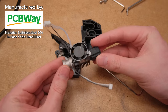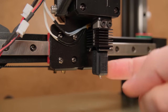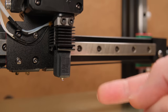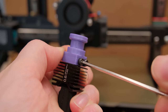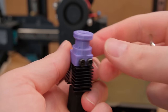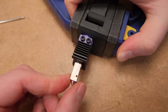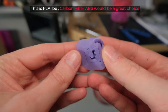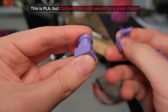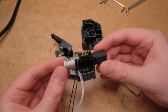The metal version allows you to tighten the hotend as much as M3 screws allow, meaning an extremely rigid assembly that acts almost as a single part. Meanwhile, the printable version is from plastic. This means you won't be able to clamp the hotend as much, and if you crash the nozzle it can go out of alignment more easily. Ideally you should use more durable, stiffer, and heat resistant filament.